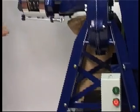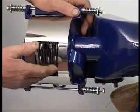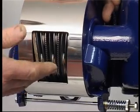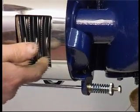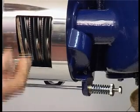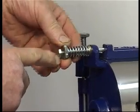The plucking head at the left of the machine here is where you offer the bird up to. The feathers are sucked in there. The maintenance on this is very low. To get the very best of your machine, and I'll show you one working in a working environment a little later on, there is an adjustment on these while offering some feathers to this aperture. You'll tell when it's grabbing at its best, and then they can be adjusted like that. The lock screw is put in position and you can pluck away for several thousand birds without too much worry.